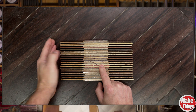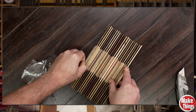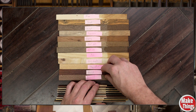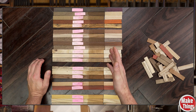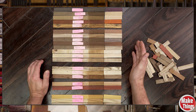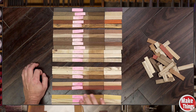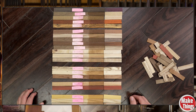Before we cut this off, I did add an arrow to show which side I added the tea to. As I do this, here's another tip: just like you can darken a piece by adding layers of stain, you can do the same with fuming by adding time. White oak can show results in under an hour, but if you really want it dark, let it sit for 12 hours or more. It looks like I misjudged how much the tape would block the vapors — I used clear packaging tape thinking it would seal the center sections, but ammonia had other plans. It made its way into every part of the wood. I went back and cut slices from the original boards so we can compare before and after side by side. The tea side is much darker — I did use four bags of English breakfast tea, so it could just be dark because of that, but that was the only thing that really made a difference on every single one of them.